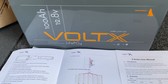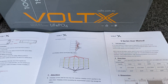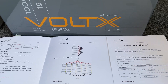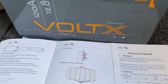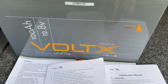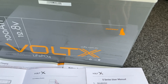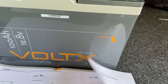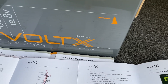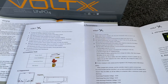It has series and parallel capability, so as you can see by the picture here, you can put six in series, six in parallel, and have a total of 36 batteries all up. So that's looking pretty good so far. They also state that they have over-temperature protection, under-temperature protection, short circuit protection, and cell balance on their new BMS — everything a normal premium battery should have.